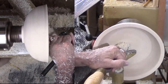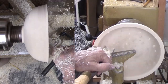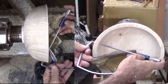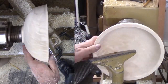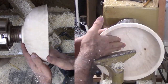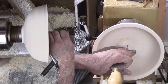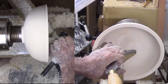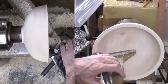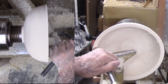Then shift focus to the bottom. My transition is a bit scary — I hope I have not cut too deeply. I sharpened my heavy bowl scraper and go for refining the bottom and the transition to the wall. The scraper does a great job on the bottom but a horrible job on the side walls. I have to pull out my gouge again to remove the heavy tear out. While I have the sharp bowl scraper at hand, I take a couple of refining strokes on the exterior to remove a couple of remaining ridges. Then sand thoroughly.